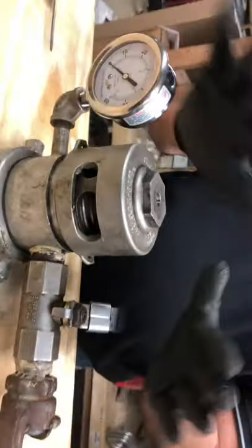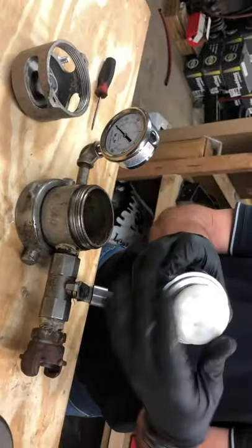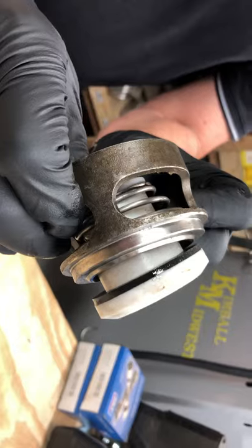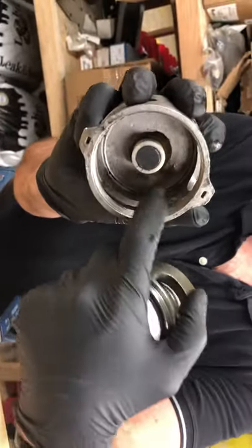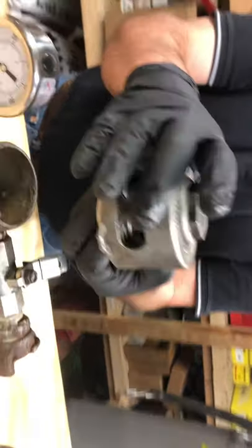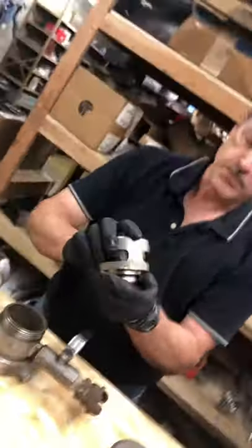What happens a lot of times is this will actually fail and you'll be leaking air through here, back out through here. Sitting on the ground, this is how you take it apart: spin off the top, put a wrench on it, take it off. Here is the vacuum plunger. You can move it around like this — this is when it creates vacuum. What happens is a lot of times it'll get cocked like this and the air will leak out and will not seal. If you look right here, that's a magnet right there and it's a magnet right here. When it fits together, the magnet holds it in place. But on this one, the magnet is not holding. This is what's going to happen if you try to take this off in the trailer — it will go right down through the washout cap into the trailer. So never take this off when it's on the trailer. Always bring it down and set it on the ground.